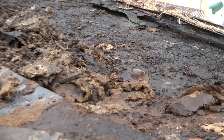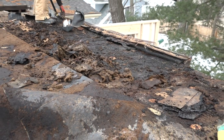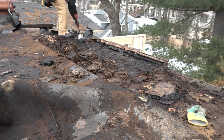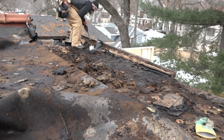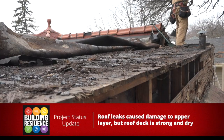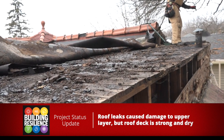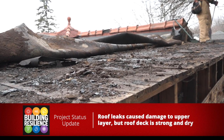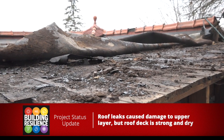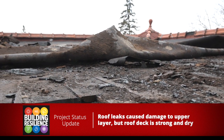What's not so cool is that they found a layer of soggy, spongy muck under the roof covering. Turns out there were some hidden leaks that were isolated but not victimless. The rubber roof had some holes in it, the buffalo board was soaked, but the tar paper that was mopped under here kept all this pretty dry, brittle, and old — which is ultimately a great thing.